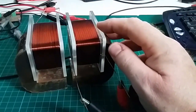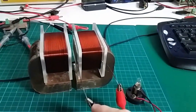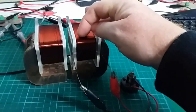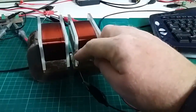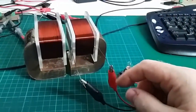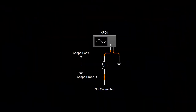So reduced impedance basically. Now again, the path from this terminal here is a resonant cavity because of the insulated copper wire. The electrons can only travel down the wire, and at resonance they travel down the wire with no impedance, or with very little impedance. When they get to the end of the wire, they reflect because there's no connection here.